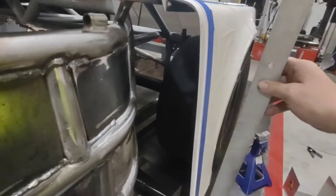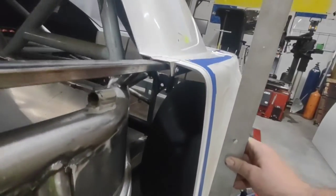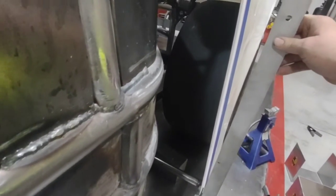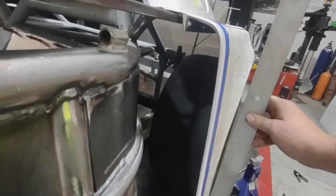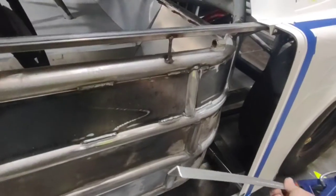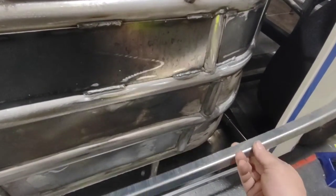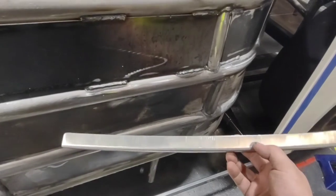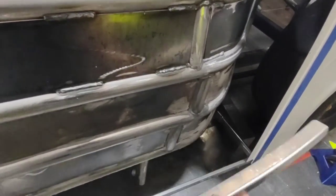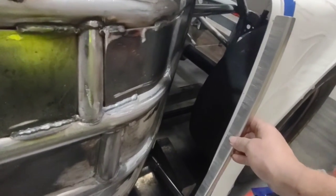When I get this one in here I'm really unhappy with its location — it's vertical, and you can see how far in the top of that door is. It's just got an angled door all the way down. To fix this, I've got this piece of 50-thousandths aluminum — it is one inch wide on the seam that I'm going to shrink, and then on this side it's one half of an inch. I use my shrinker to get the same contour that I'd like to see in the door.